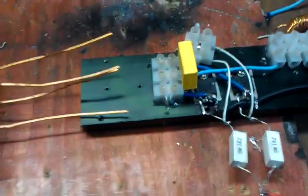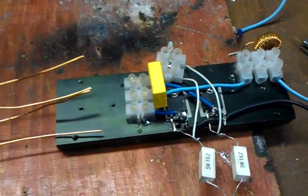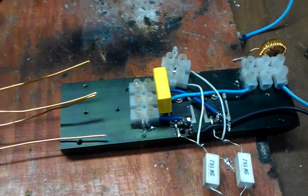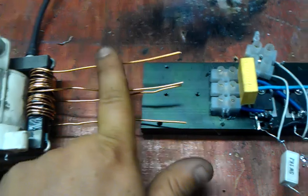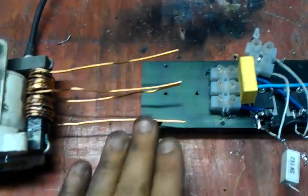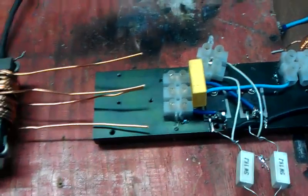A while back, Jake said he'd like to see what the low-voltage side looks like on an oscilloscope, so I'll be doing that for you guys as well. I'll bring the oscilloscope out, plug it in, and look at the waveforms that are created, and also see how much noise is actually on the output. My oscilloscope is good for 600 volts peak to peak. I wouldn't think I'd see much more than that back through these windings, as the field collapses inside the flyback — you get a bit of a shock back through the main winding. These transistors are only 100 volt, so it can't be much more than that.